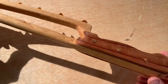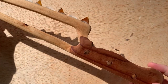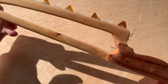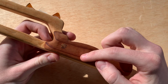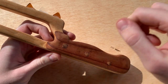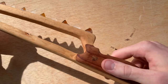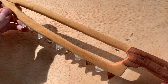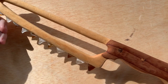The most common wood you're gonna find is pine, and I made this sort of knife-looking thing a while ago with two different kinds of pine. I really don't enjoy working with pine — I stay away from it. It has these knots, and you'll find that the growth rings are a lot harder than the wood in between, so your tool kind of gets stuck, and it's hard to get consistent lines. Also because it's so soft, you'll see around these dowels that it's splitting. It's hard to get a nice shiny finish on it. It's really cheap and it's everywhere, but I would stay away from it when you're carving.